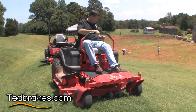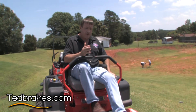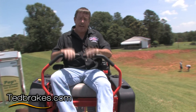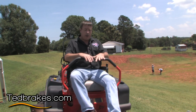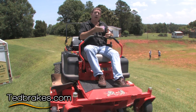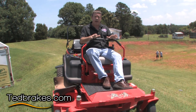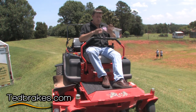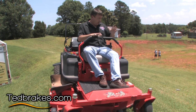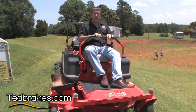The park brake is this right here, which is not the best position — I would consider it to be a foot position because everyone is used to a car — but it is usable in the case where you could not get control of your levers because of loss of power, run out of fuel, or pump belt breaks. We're going to demonstrate what happens if any of those conditions were to happen on this hill. If your engine fails for any reason or you blow a pump belt, you're going to have to be able to get to the park brake, because we're going to show you how little effect the service brakes have.